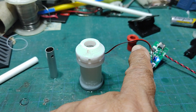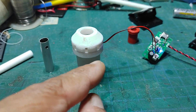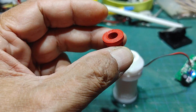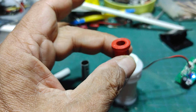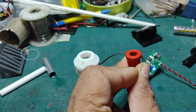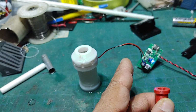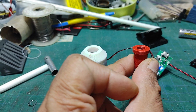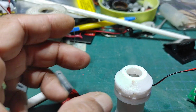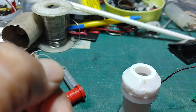so that we can pour the water from one of the entry points, or one of the exit points, on the locomotive. The locomotive has a stack, which is a part like this but bigger and wider at the top. It's at the front, the one that generates the smoke stack, and then there's another opening on the top of the locomotive. So I am going to marry this entry point here with this part here, so that we can pour some water here with a small bottle. We can fill this tank right here for a more continuous smoke operation.